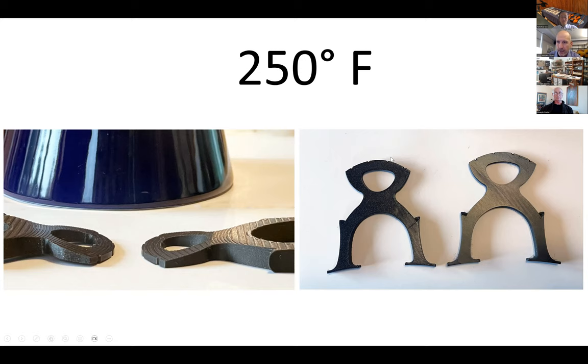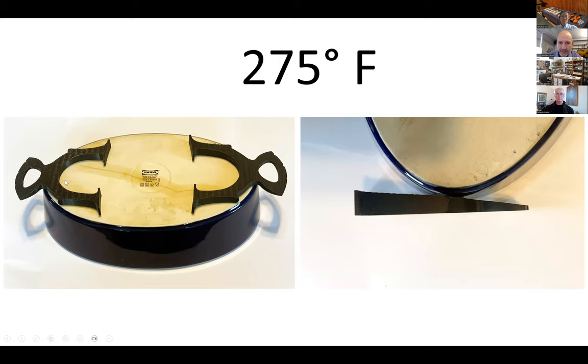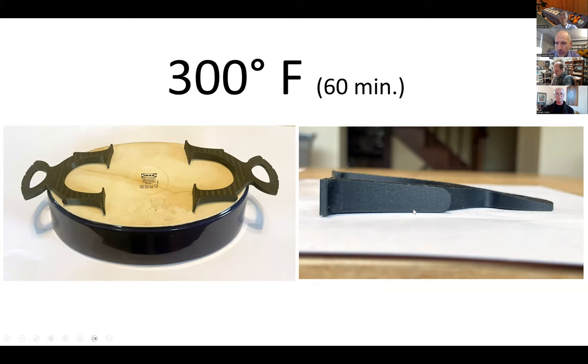Whereas annealing a carbon fiber, this particular brand of carbon fiber, it doesn't have any problem with, or at least the shrinkage is so subtle that I wasn't able to notice a difference. And you can see it's still perfectly flat, no discernible warping. So up to 275, the PLA is still holding on. I presume that because of the shrinkage, it might have been getting a little lateral support. But the carbon fiber PLA is still not warped. At 300, you start to see just a tiny, tiny question of warping,